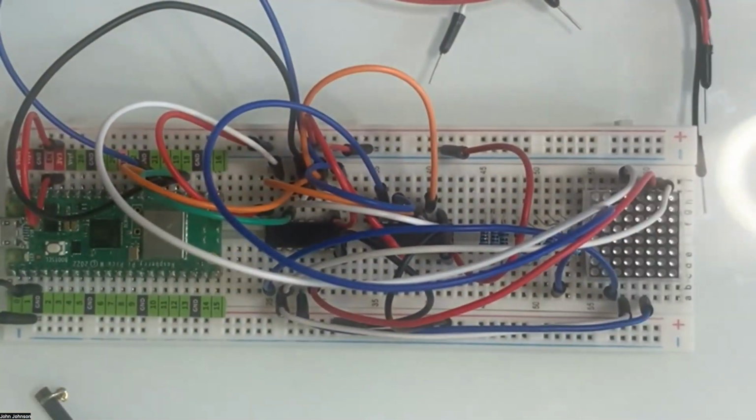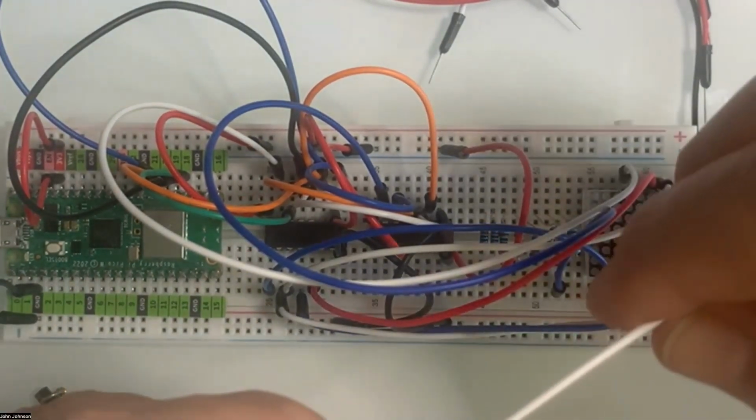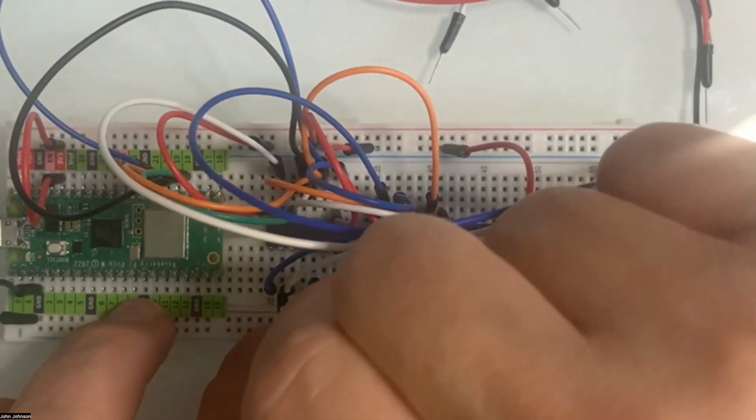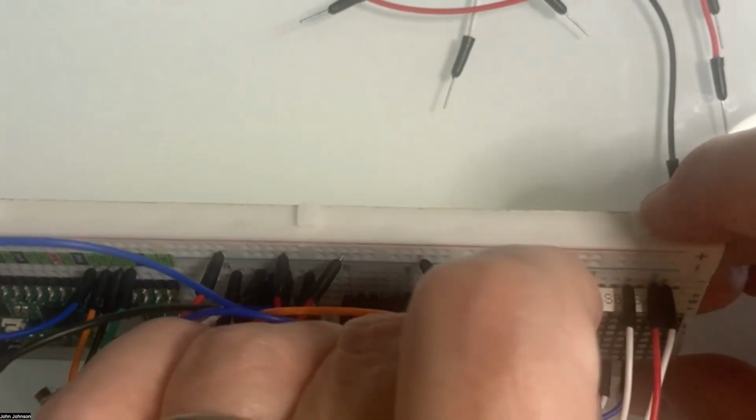So we've got that. Now the next one to do is the orange. So we're going to do 1, 2, 3, 4, 5. The sixth pin on the bottom side of the IC is going to go to the second over from the LED, the second over from the left. Wow, this is getting kind of crazy. So this is going to go here to the second from the left. So I can put that down.